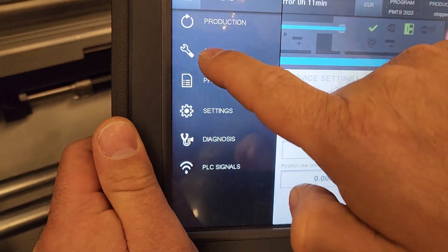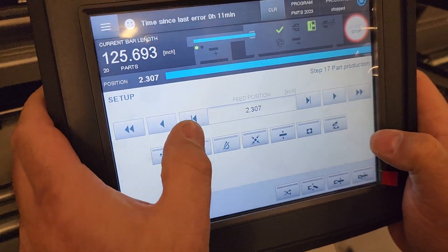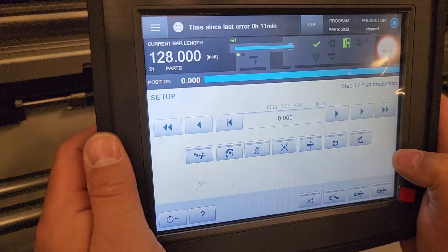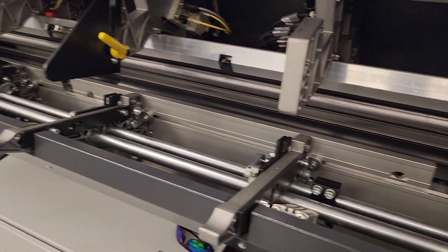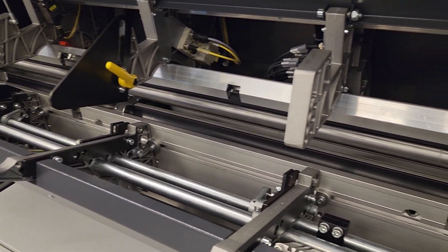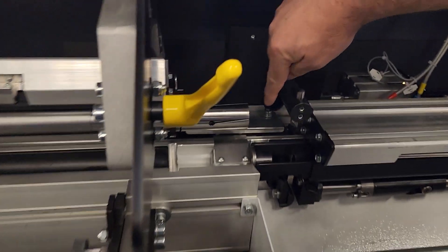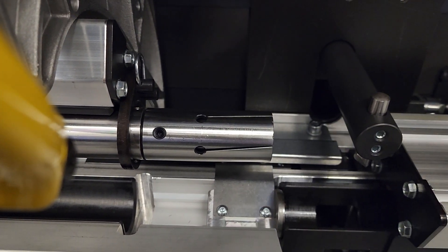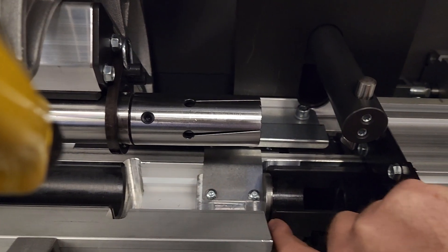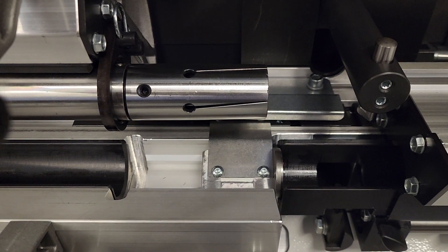The second parameter we need to adjust is relative to the pre-feed position or short pusher feed position. In order to adjust that, we're going to open the channel, the pusher swing, and jog the short pusher or pre-feed pusher forward. We want to position it just slightly in front of the front edge of the pusher collet — it must be in front of that front edge. Usually this is roughly equivalent to the back edge of the remnant swing in most cases. We're going to adjust that pre-feed pusher to that position.